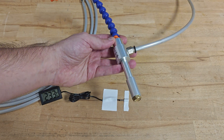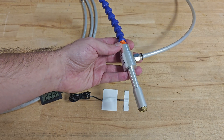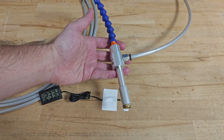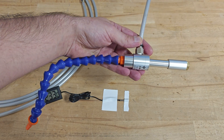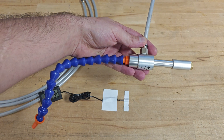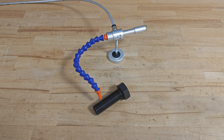So if you're planning to purchase this model or another — and there are some quite powerful vortex tubes out there — you'll need a better compressor than the Black and Decker I have here. By more powerful I mean a tube capable of producing freezing air of minus 60 degrees Celsius and a cooling capacity of 32,000 BTUs per hour. Well fellas, I think that's enough for this review. If you find the video informative, you know what to do. Bye guys, see you soon.